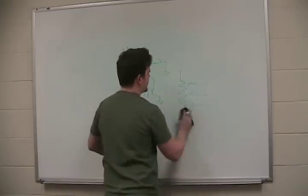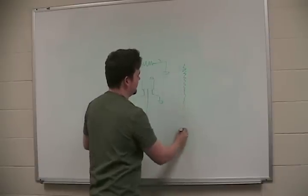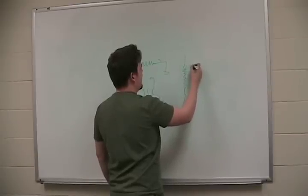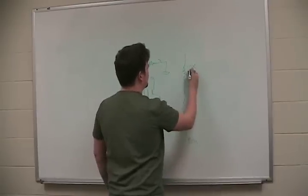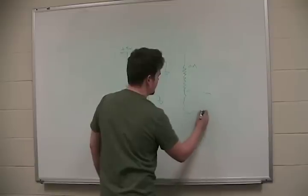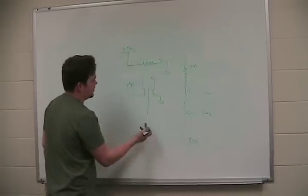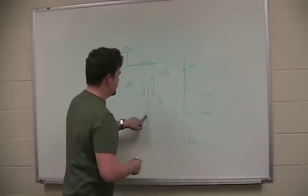Realistically, look at it as a big resistor. If we're looking at a 50K potentiometer, we've got zero ohms and 50K ohms here. Are we pointing to the zero ohm part, or 10K, or the 20K area, or the 50K? You're going to get different voltages along there. As a voltage divider, if I change this, I will be changing the voltage here between 5 volts and 0 volts.